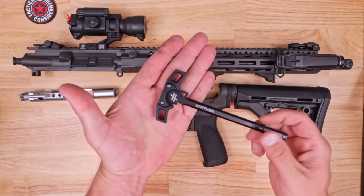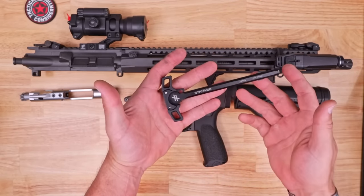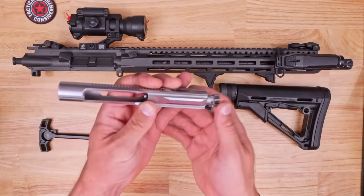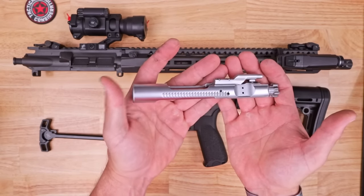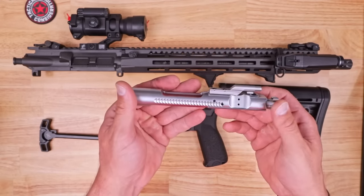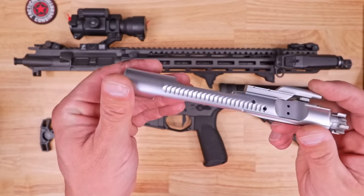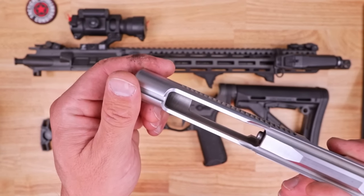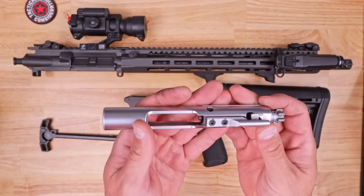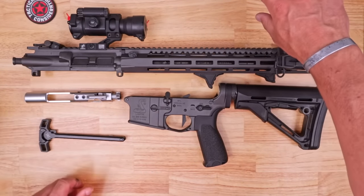When it comes to the upper receiver and small parts, I've got the Blackout Striker charging handle — love what Blackout's doing, they're coming out with really good stuff because they want to control everything in-house for their custom rifles. I think I've got coupon codes for that. I had this chrome bolt laying around — it was sitting in a box and I forgot I had it. I think this one is by Young Manufacturing, still local to Arizona. It's not bad, has serviced me well, but the machine work down inside is god-awful. Externally it's great, but inside the valley it's pretty gnarly. Properly staked though — and I've never had one of their bolts fail.